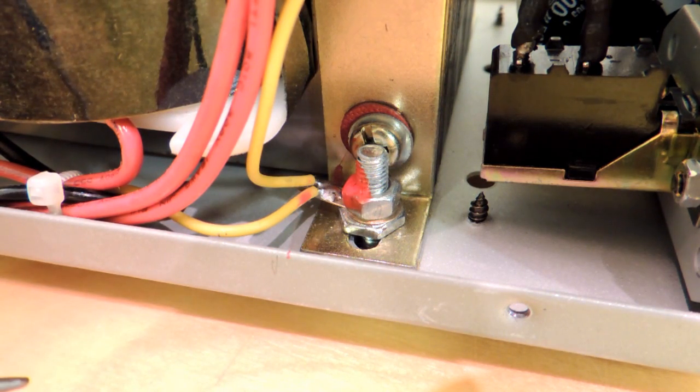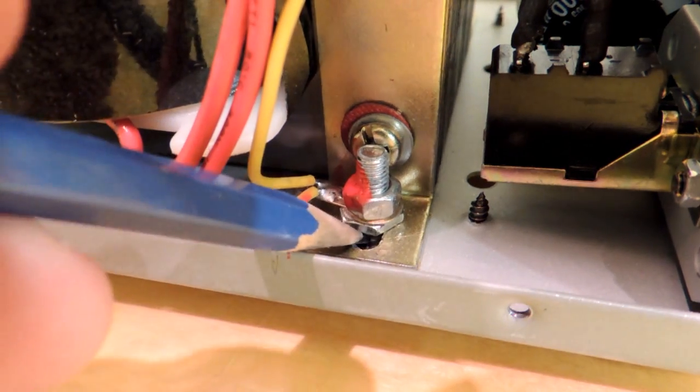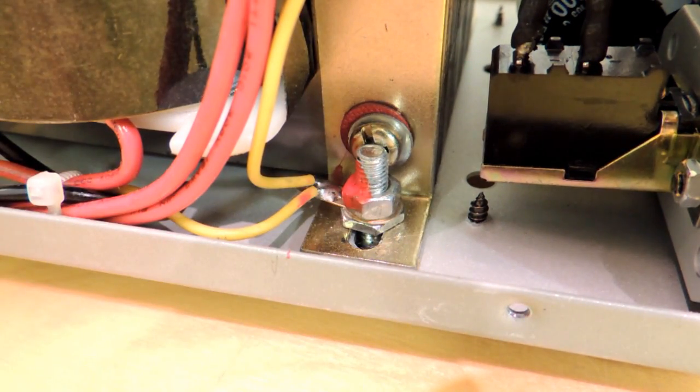Fortunately, the front panel chassis ground and the rear are actually connected together by solder, but the chassis can float because what they forgot was a locking washer or split-ring washer — that's pretty basic. As you kind of expect when you pay modest amounts of money, you should open these things up, make sure they're assembled correctly, and fix it. It's easy to fix — just pick a washer out of your junk box and put it on.